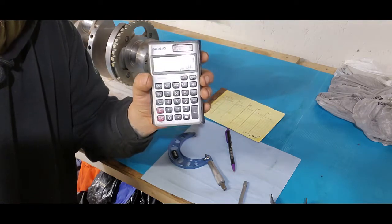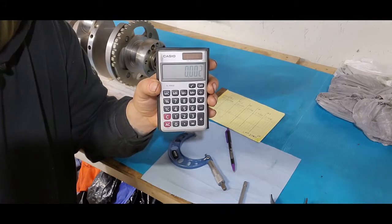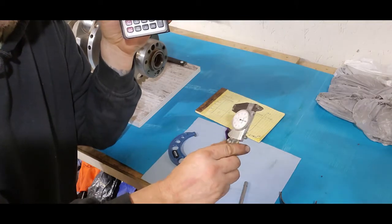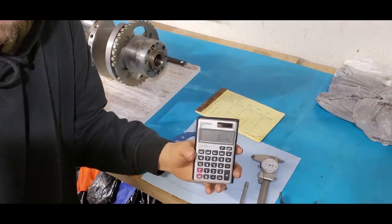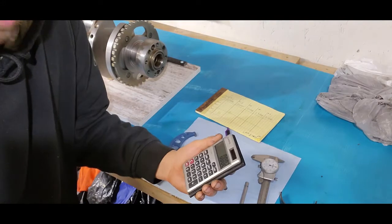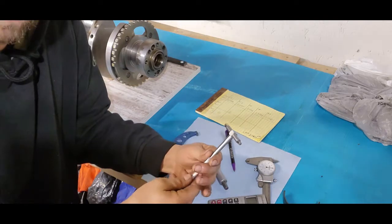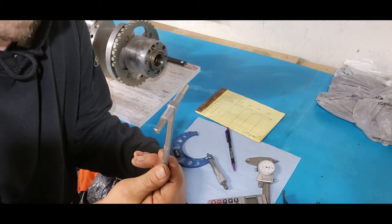So now I'm going to get that dial bore gauge set up when I get back from getting some food, and we'll get our dead nuts measurements, using a mic over a caliper when you can. These are very accurate pieces, but you'll have a hard time getting to the fourth digit. And on these motors that run 2 thou clearance, that fourth digit's kind of critical to know, because you could be a thou over or under where you're targeting if you don't have that fourth digit. But I thought it'd be kind of cool to show you an actual use for a telescoping gauge set. These are pretty cheap to get. And like I said, we just did a quick reference without a lot of work.